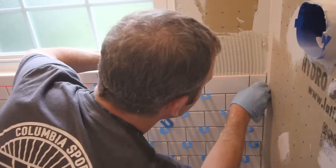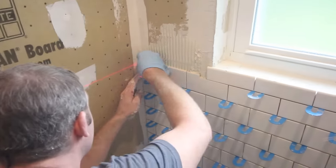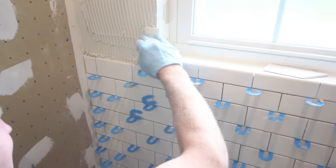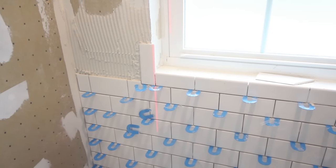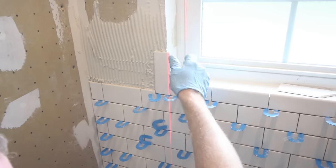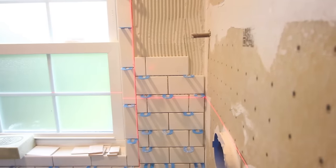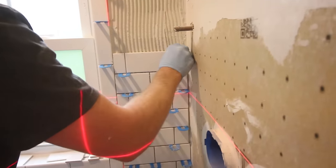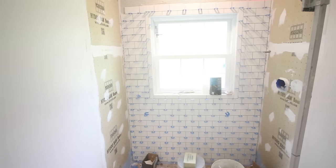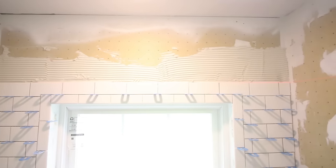We're filling in the rest of the tile on that last row just below the bullnose, and we're going to be climbing the wall and maintaining that pattern. Our bullnose is nice and plumb, and we just kept our laser on it as we went up along the window edge. We're maintaining our pattern — yes, we have smaller tiles on each side, but we felt that didn't look bad. And we went the entire way above the window maintaining that pattern, with our bullnose picture framing the window.